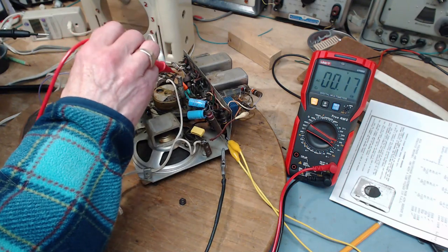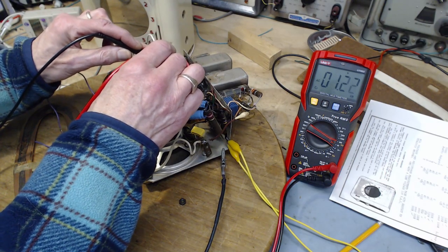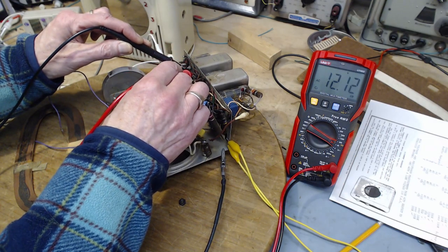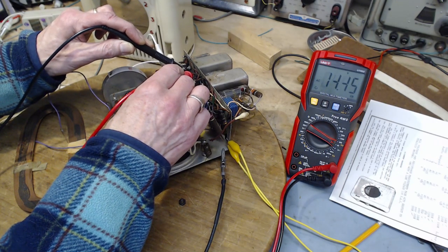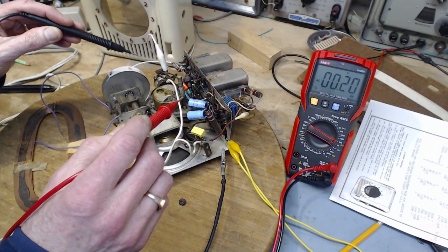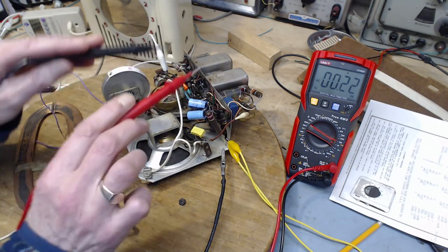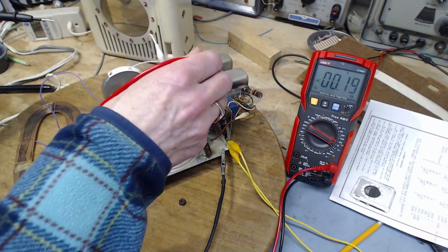When we come up to this one, we count 1, 2, 3, and 4. Hopefully it's still 3 and 4. Saw 14 there again. Well, we saw 14 for a moment. That's the same voltage. So two 12 volt tubes. Now we're at the 50 volt tube here. I don't know the pin out on the other tube. You can't get at it with this to test it. So somewhere we should be dropping 35 volts before it gets to the string here.